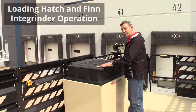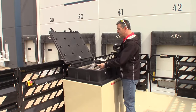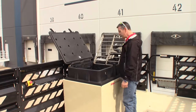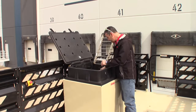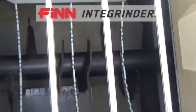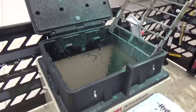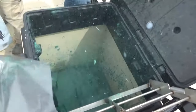To utilize the grinder, just open up your hatch and drop your seed and fertilizer in through the grate. There's a breaker bar here for bags of lime and fertilizer. When you're ready to put the mulch in, open your grate, cut your bales, drop them in the hatch, and the grinder is going to work nicely. Those paddles protrude through the bottom of the basket and cut the bales. The water curtain is produced by the fill port — this diverter bar right here cascades water over the mulch as it's being ground up.